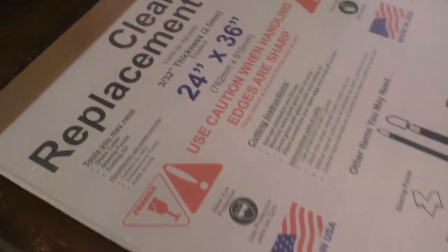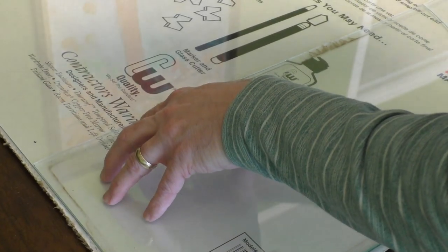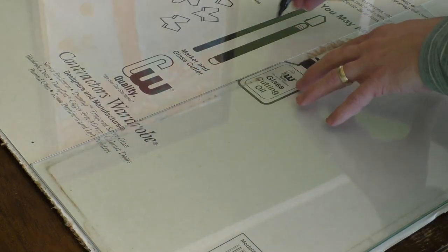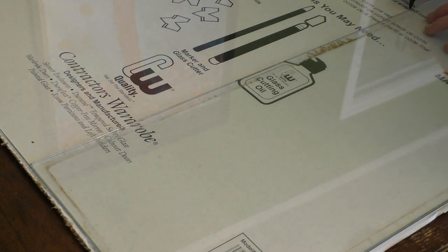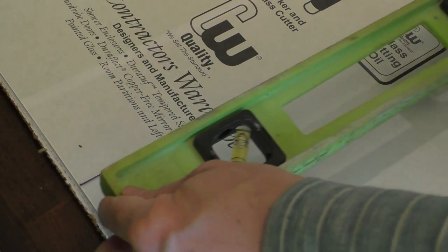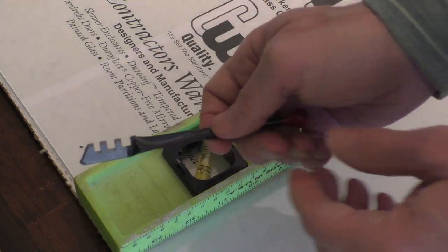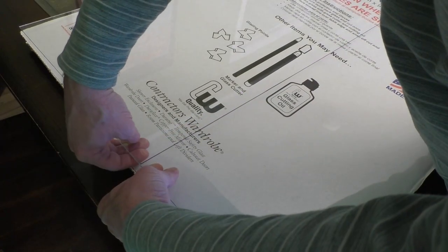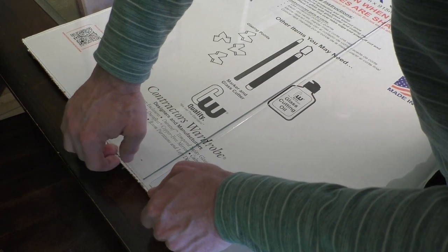So you will need to get replacement glass. Either get 3/32 inch thickness or 1/8 inch thickness. And if you can, try to save the original glass — you can use it as a template to measure the new glass. Perhaps the scariest part of the project is cutting the glass itself. You can always go to a hardware store and if they're nice, they will cut the glass for you per size. Or you can try to cut it yourself, and with a little practice, you'll make the perfect cut.